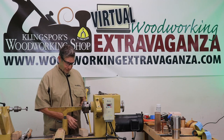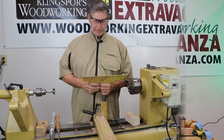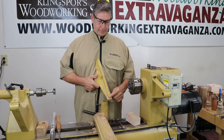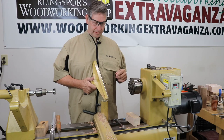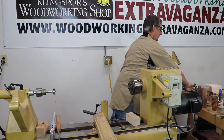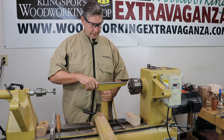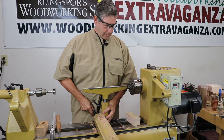The first thing I like doing is a little prep work on the lathe — for new guys and old guys alike. The first thing I do is clean all this off. Even if you've got a new lathe, I take all that paint off, sand it down, and buff it. When you're done it'll look like this, and that'll make your tools run a whole lot smoother because that's what you're going to rest your tools on and you want them to slide easy.